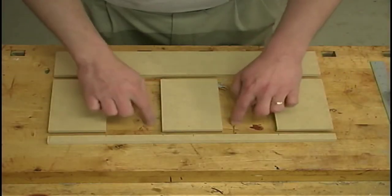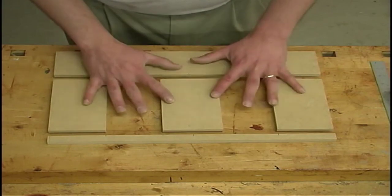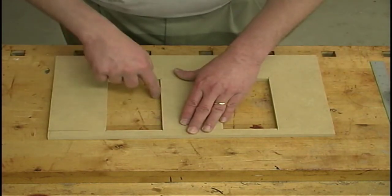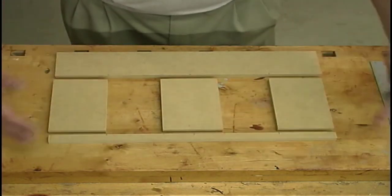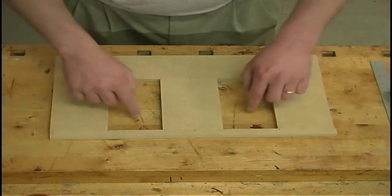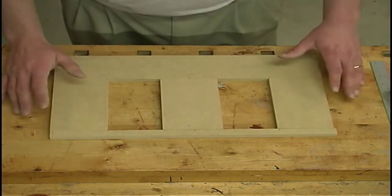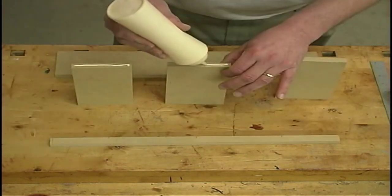The templates for making the top pieces — to mill out the pockets as well as the outside profile — are actually probably easier to make out of several small pieces glued together. Because we have to do routing on these inside areas, it's very difficult to take a jigsaw or even a scroll saw and cut out a nice square opening, but it's very easy to cut the individual pieces and glue them all back together again. This template will be used to machine the two outside pockets. We'll need another template to machine the inside pocket and the outside profile. Both of them are constructed the same way, so I'll just glue everything together and wait for that glue to set up.